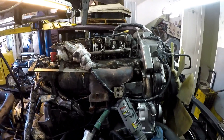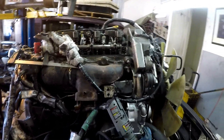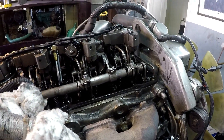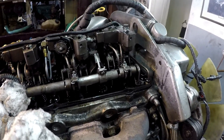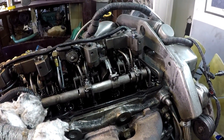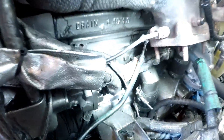The fuel modulator on these series of engines was designed to reduce emissions and save fuel. Without that unit, when you accelerate you would demand full fuel on the rack and emit black smoke before the boost came up. So how they worked around that is they made this fuel modulator — it's just a cylinder with a piston in it — and it runs off of boost pressure. I've just hooked up the boost line here, and it runs from the air box, off air box pressure.